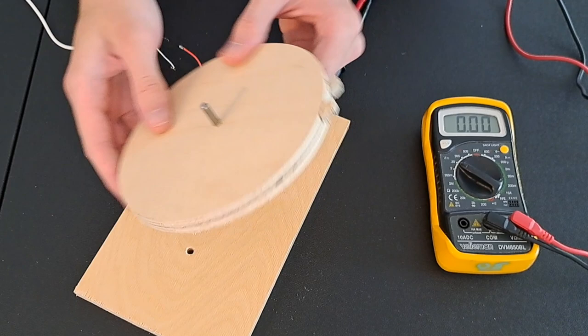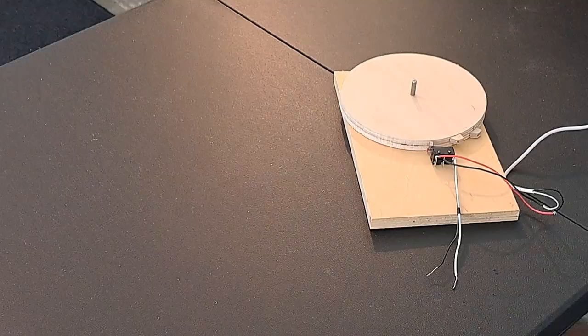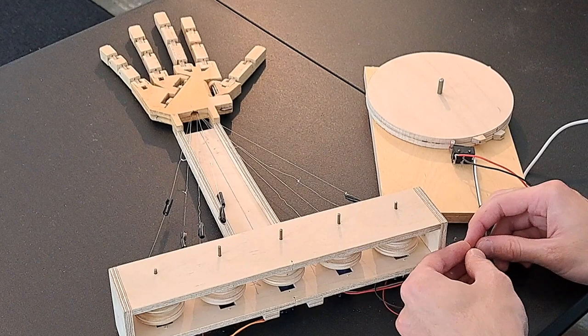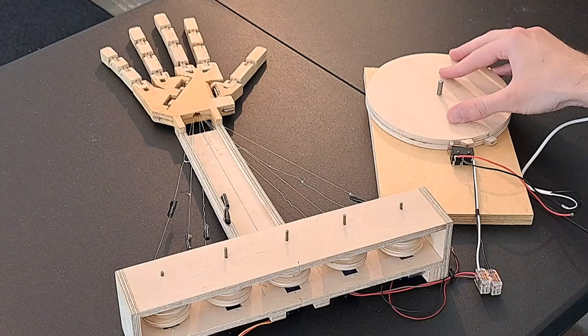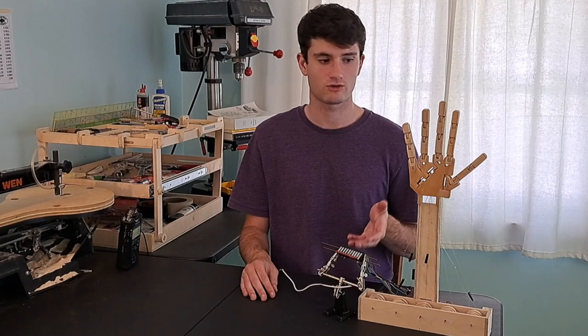Using a pinwheel with these cams, I can automatically turn the voltage on and flip it. A control mechanism like this is the heart — or rather brain — of most automata. It's similar to a music box, and automata in the Middle Ages often adorned automated organs and clock bells, though those were purely mechanical whereas this is electromechanical. This way, just by rotating this, I can cause the finger to move. With a gang of ten switches, I can control all five fingers.